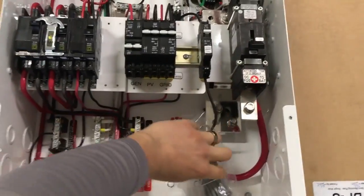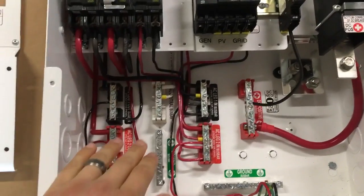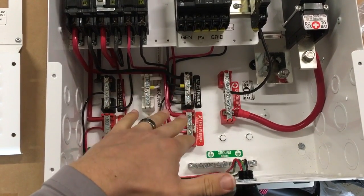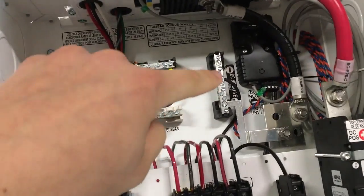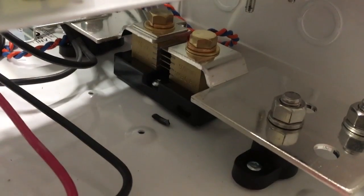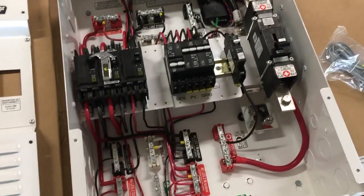When I go into an AC coupled situation I really like to have the extra bus bars inside the MPSL. What's nice about the MPSL is it comes with an AC leg in, AC in bus bars, AC out bus bars, neutral, and a couple of different ground bus bars. You also have a DC positive bus bar, a DC negative bus bar, and here's the shunt in the back — plus a nice bus bar to bolt battery cables on.